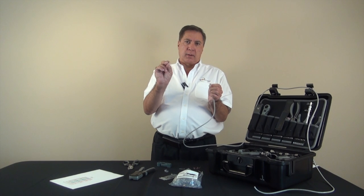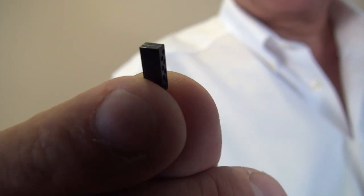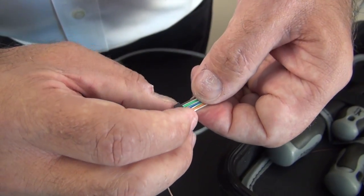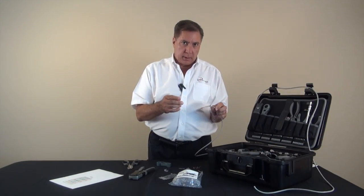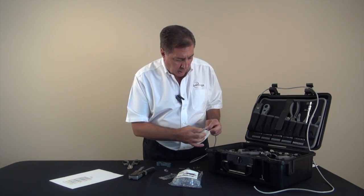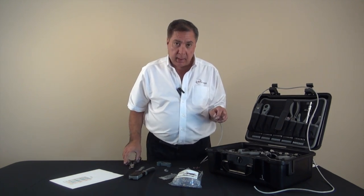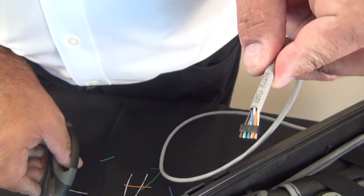At this point we're going to prepare to put the load bar on. The load bar has two sides — one side is flush and the other one is hollow. The hollow side is going to go into the wires first and the flush side will be facing out. Now we'll proceed to put the load bar on. We're going to get the load bar approximately a little more than a quarter of an inch away from the skin point, and we're going to take the wire surgeon scissors and make another cut which is about a sixteenth of an inch past the end of the load bar.